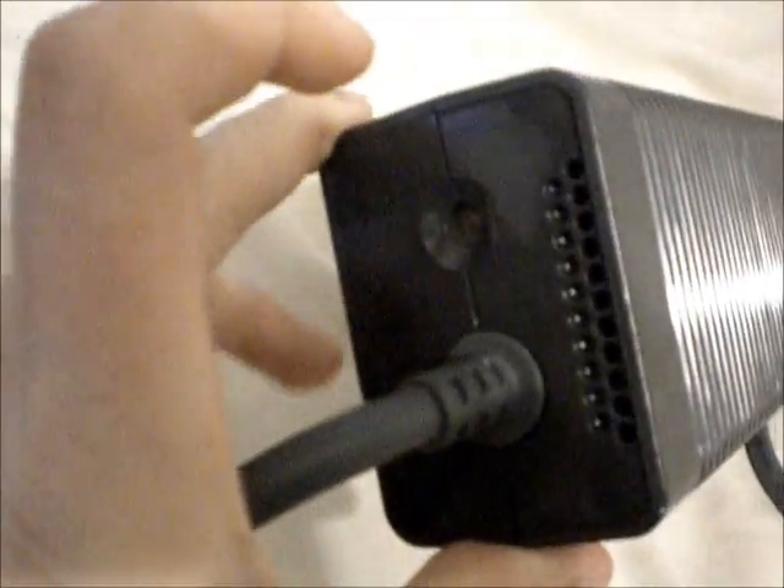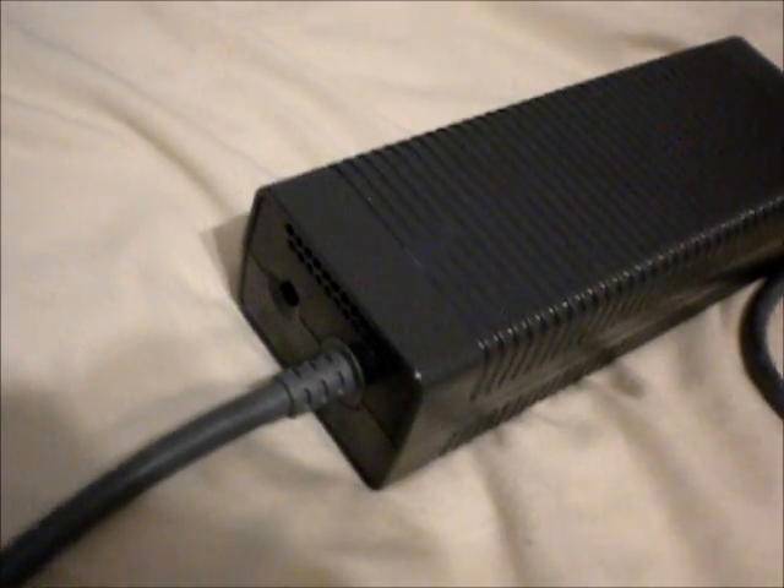The way you can tell if it's working — when you plug it in there's a light here. If it's yellow, that means your power OK does not have voltage going to it. If it's green, it does and the 12-volt lines are on. And if it's red, that means it's shorted out and you just have to unplug it and plug it back in.